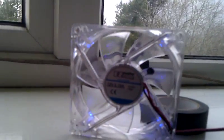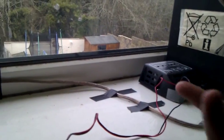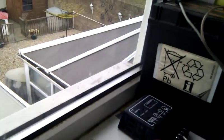I'll find out eventually if it is or not. But right now I've just got this little fan hooked up straight to the panel output. That's why it's not turning because the sun's gone away now — it was going quite well earlier. Interestingly, the other day when I was in direct sunlight, the fan actually has the exact figures on it. I managed to get about 12.5 volts — remembering this is a standard charge controller so it drops it down to the battery voltage — at 0.15 amps. So it's about 2 or 3 watts. Not brilliant but 2 or 3 watts an hour for 8 hours a day, that should be plenty.